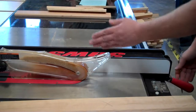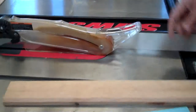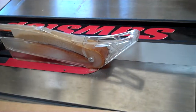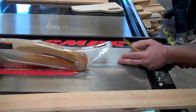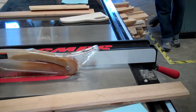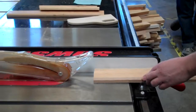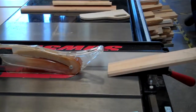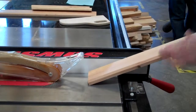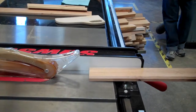We could have gotten one board and cut it at two inches, then a different board at one inch — that would work. But this is a little bit easier and faster. You only have to do one cut and you get two boards. Plus if I have my fence set at one inch, it's so close to that blade I can't really get my push stick in there. So set it at two inches, cut the wide board and we'll get our leftover piece. It doesn't matter which edge you put against the fence, and X up or down doesn't matter. Just cut it right at two inches and use that push stick — get those hands out of the way.